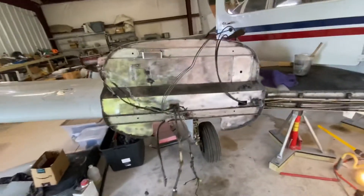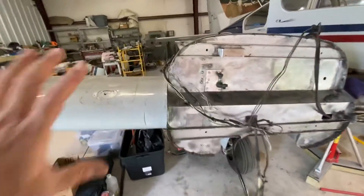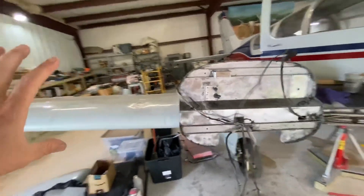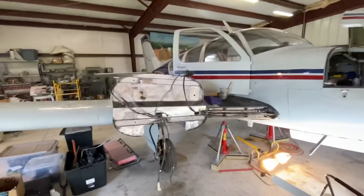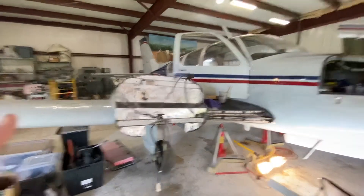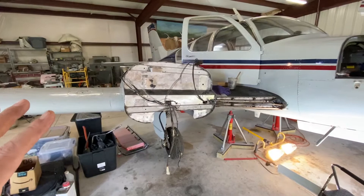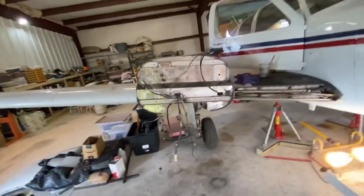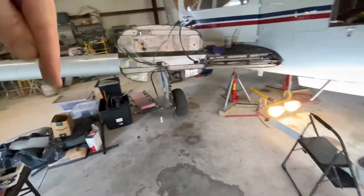What is meant by critical engine is that the thrust, instead of being on the inside, is on the outside — the main thrust is pushed clear out here, which creates a really bad yaw. If you lose that engine on takeoff and you're below minimum controllable airspeed and don't pull back both throttles and land straight in with whatever you've got, the excess thrust off the prop will drive it over and usually turns it upside down, going in right around the end of the runway.